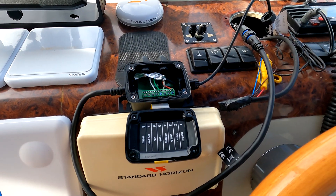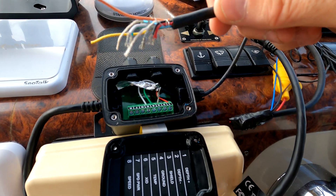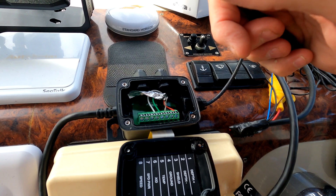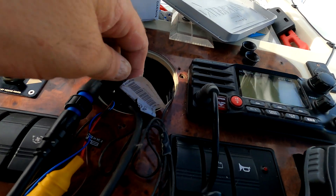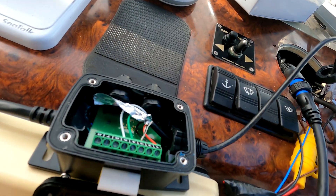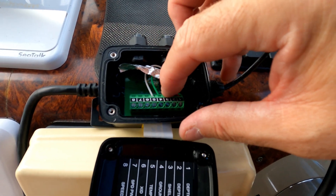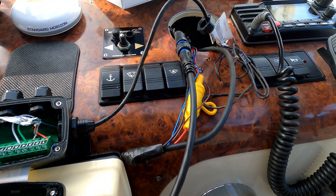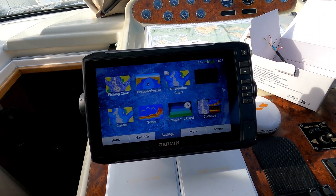I have to admit I made a small mistake. When I was wiring this cable, I connected the shielding wire to pin three — but I used the shielding off the temperature core, not the shielding off the main feed, and I couldn't get it to connect. So what I've done is I dumped that cable completely and did exactly what it says on the tin. This is a dual frequency transducer — a relatively old device but still works well and is compatible. I followed the exact same wiring diagram, putting the leads in exactly the same place. If you do this yourself: use the shielding off the main feeds, not the shielding off the temperature feed. Then connect that to the 8-to-15-pin lead and into the plotter.